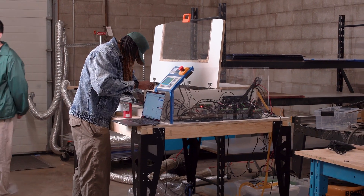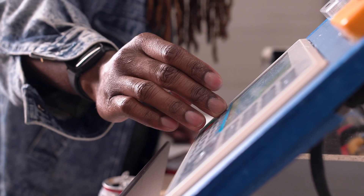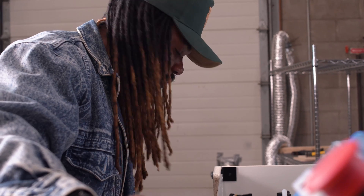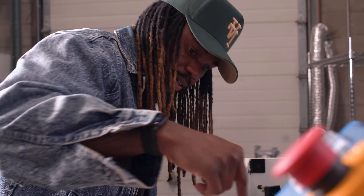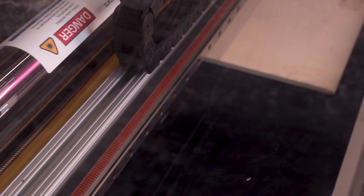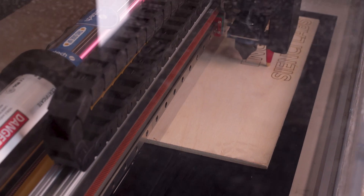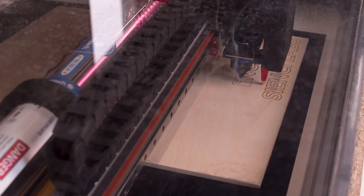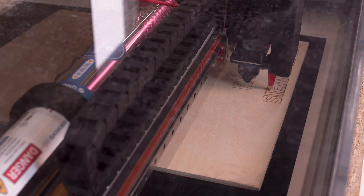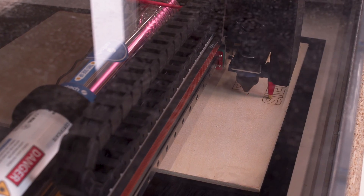Because this is a dedicated CO2 laser CNC machine, we get to run things a lot faster. We're trying to hit different metrics than you would on a CNC router. We can aim to move a lot faster than even the Alt Mill. The Alt Mill can reach probably about four times faster than the Long Mill, but this machine will be able to move 10 times faster than the Long Mill. We're playing with higher speeds when we dedicate the form factor to the functionality of laser engraving and laser cutting.